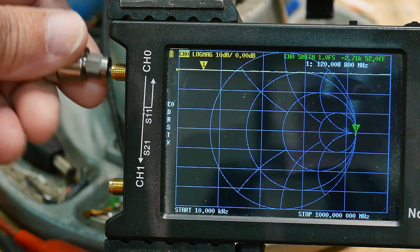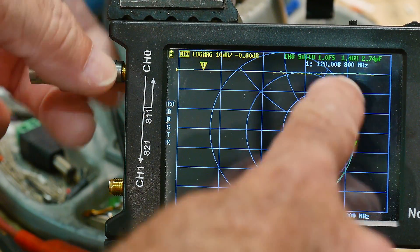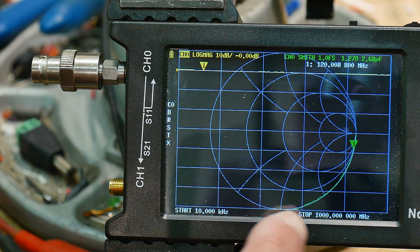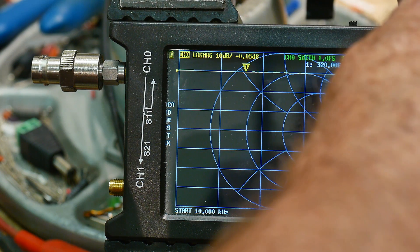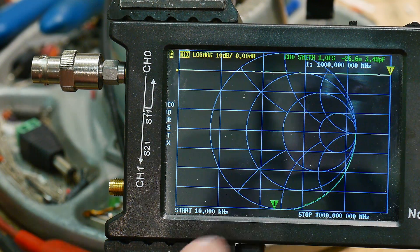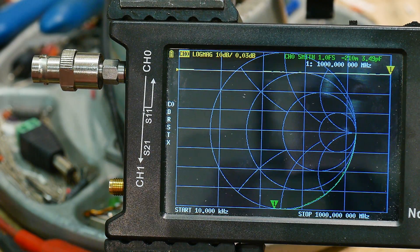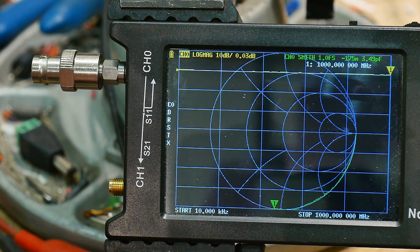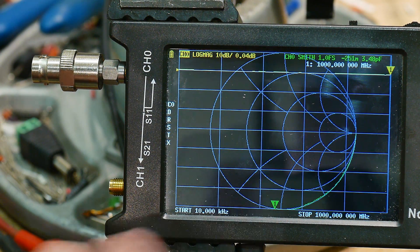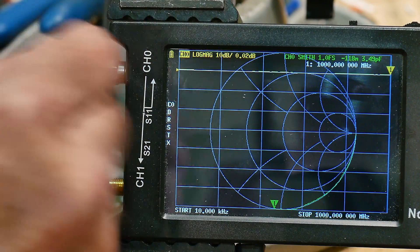The problem with adding an adapter is you're going to get a phase change. You've calibrated at the port, but now you've added electrical length. The electrical length causes phase shift, which is dependent on frequency — more and more portions of your cycle will fit within that short length. Instead of being at center, we're now offset. We could calibrate at a new distance, and that point would go back to zero — you can tell the VNA where zero length is.